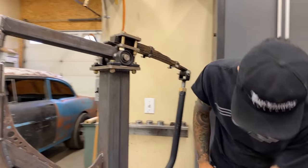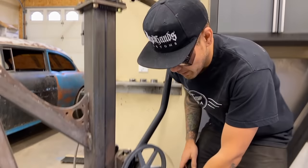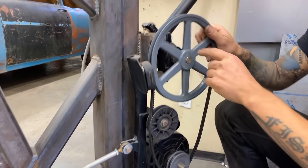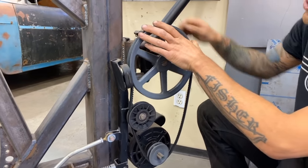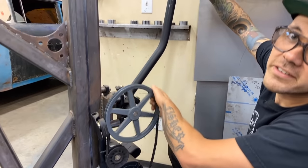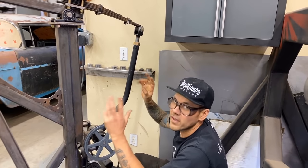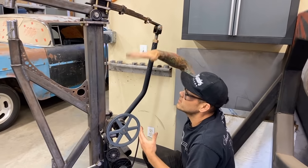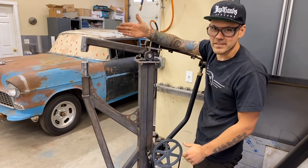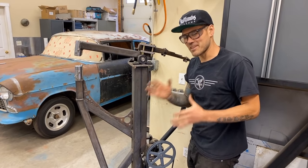So we've got a single speed 220 volt motor. It's 2 horsepower. It powers this pulley here, which is a machined crankshaft with a bearing that goes up and actuates this spring here. That's the Helve hammer design, a sprung fulcrum point hammer, I guess you could say. I'm not really an expert in machines, but I'm gonna give you the best explanation I can as to how it works.